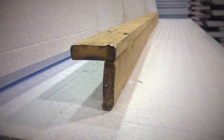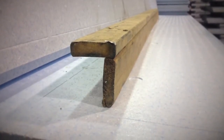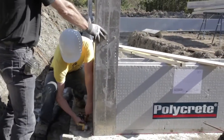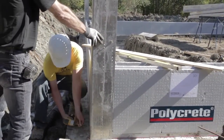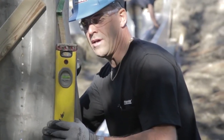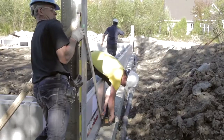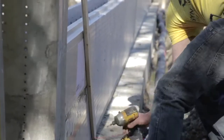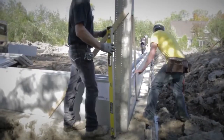Interior wooden corner preparation. Installation is made of 2 wooden strips set at 90 degrees. Exterior aluminum corner guide setting after first row installation. 1-inch by 3-inch wooden braces are installed at 2/3 of the foundation height, or ICF assembly, and attached from the starting base or last row of the previously poured ICF assembly.